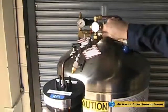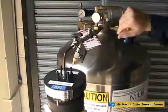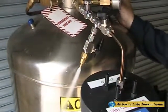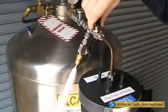Open the mini-bulk tank's liquid source petcock valve. Within a few seconds, snow should begin to be generated and exiting the purge valve. Let the tank purge for about 10 seconds, then close the purge valve and immediately open the snow valve.